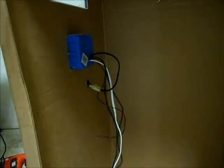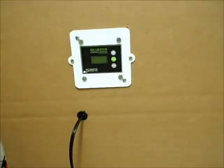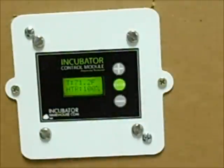Plug this in from the outside and you can power it up. It comes on. We can see the temperature reads 71.2 — that's the current temperature inside the incubator. There is no heater in there. It shows 100% power going to the heater, although there is no heater attached right now, but it is still sending 100% of the power through those wires. This is a proportional thermostat, which means that as the temperature gets closer to the set point, the percent power going to the heater will decrease.